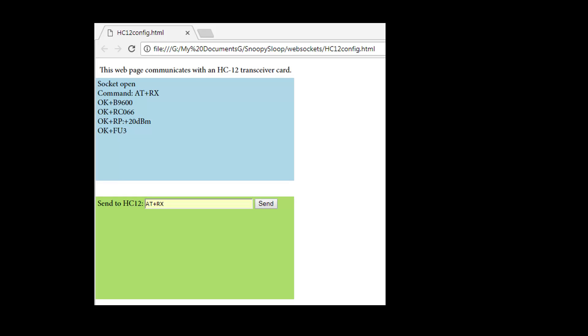I've also done further tests after reconfiguring the HC12 as shown here: changing the frequency from 434.2 MHz to 459.4 MHz, and increasing the power from 10mW to 100mW in the hope that would increase the range. I've also changed the aerial from the helical one to a quarter wave whip aerial, which I'll show you in a minute.